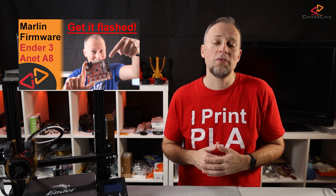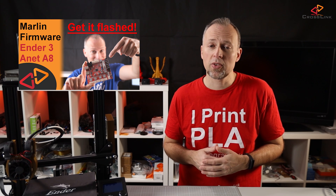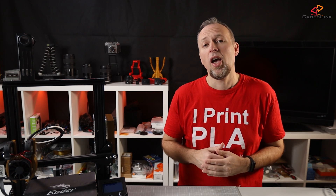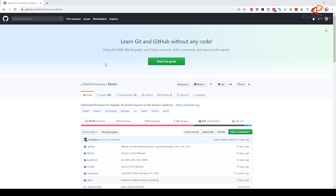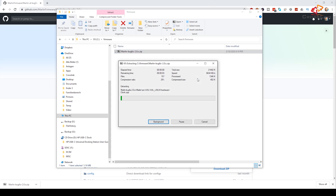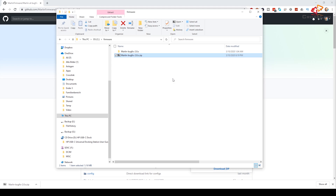I have made a video to explain how you can flash a bootloader to these mainboards — it's linked in the info card up here. If you find out that you're not able to flash firmware using a USB cable, go and install a bootloader first and then come back to this video. With that out of the way, you need to download the Marlin firmware from GitHub to your computer, either on a Mac or PC. The GitHub link is in the description. Click on the Clone or Download button and select to download a zip file, then unpack it into a folder on your computer.